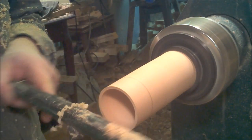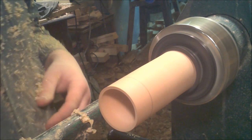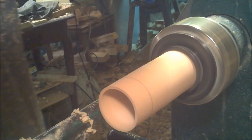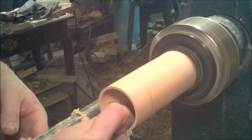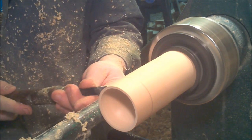You can start out with a heavy cut and then end with a very continuous light cut from the center of the bowl out to the edge — and that's all you've got to do. You've made the inside of a bowl. Using a pencil I measure the depth of the bowl, return the tool rest, and now sand away that pencil mark and refine the interior of the bowl.